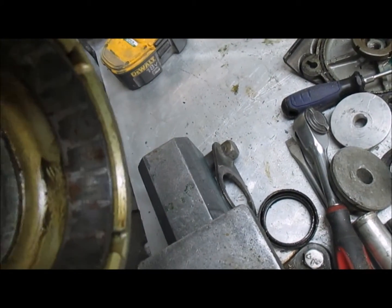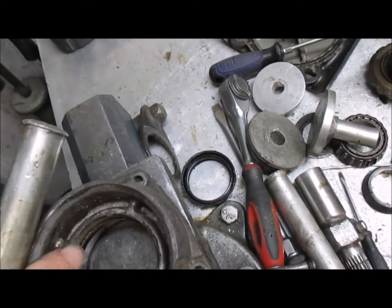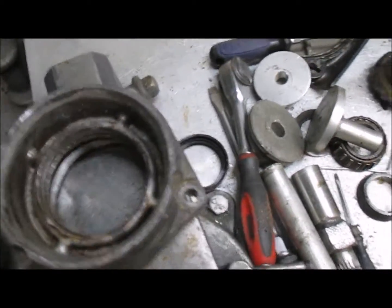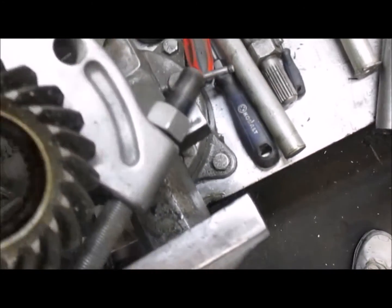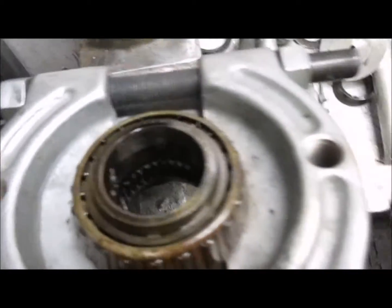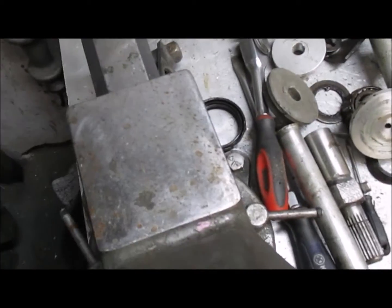After you get it to drop about an eighth of an inch there, you'll have to go to an area where it's not flat, so that it'll leave the thing, but it comes out relatively easy, no big deal. The other thing is, to remove this bearing, you will need a bearing remover that looks much the same as this. We do carry this. I'll grab one out of stock and get the number for you.